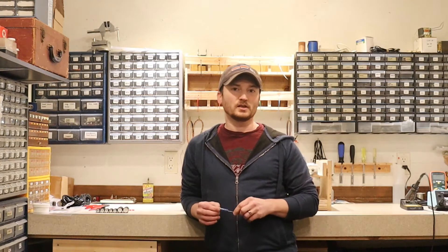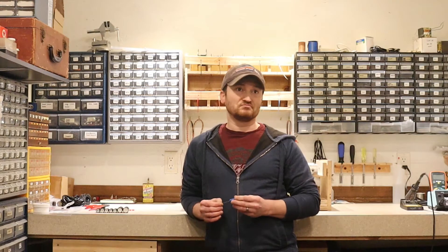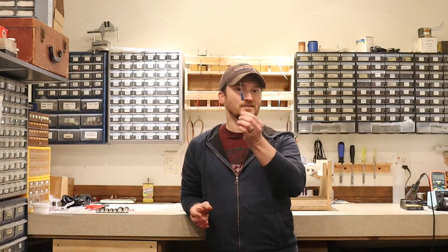When you're buying electrolytic capacitors, a typical run-of-the-mill general use capacitor is going to be about a thousand hours. If you get a decent one, it's going to be a 3,000 hour capacitor. A really good one might be a 5,000 hour capacitor. This is an 8,000 hour capacitor. It's also rated for twice the voltage, so it's not going to have that extra stress on it that would cause it to drift off value over the years. I would say this is going to be good for another 40 years probably. The next person that goes in and works on this amplifier will undoubtedly not know what it is, not know that it's an 8,000 hour capacitor and replace it anyway — and that's okay, because at least we know it's going to last that long.